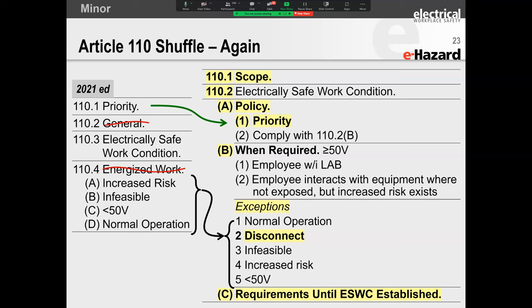What this means is that if I end up in court and I have a really smart attorney out there, that attorney could simply ask me the question. So what you're saying is that let's say there's an arc flash hazard. Let's say we've got 6 calories per square centimeter, but we know that arc rated clothing is available. So if a person uses minimum 8 or minimum 12 calories per square centimeter protection from head to toe for an arc flash, then even if an arc flash occurs, technically speaking, that worker could be safe. And to answer that attorney, as a subject matter expert, I'm going to have to say, practically, you are correct. So what this is basically saying, and I firmly believe this was an unintended consequence, is that for lockout tagout purposes, if you do a proper risk assessment and you are faced with these hazards, you can go ahead and operate this equipment without it being in normal operating condition.